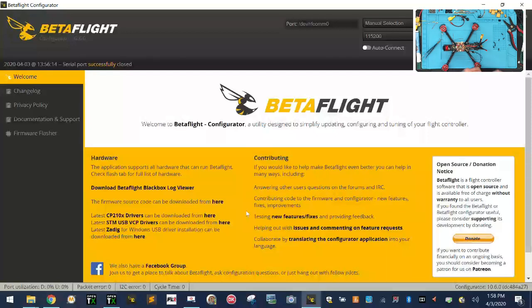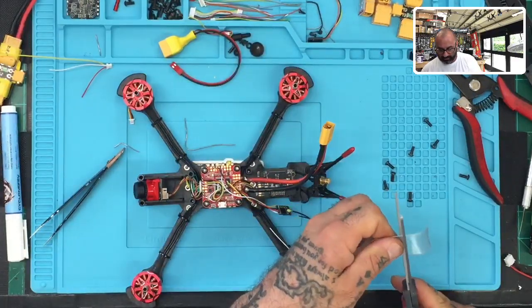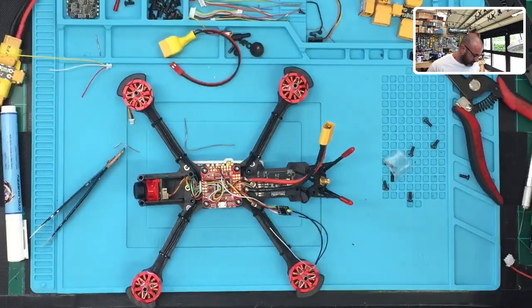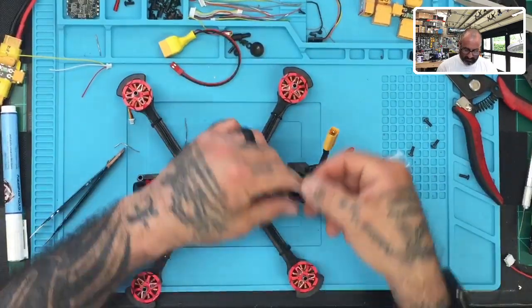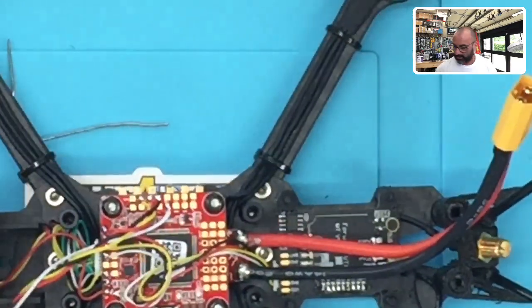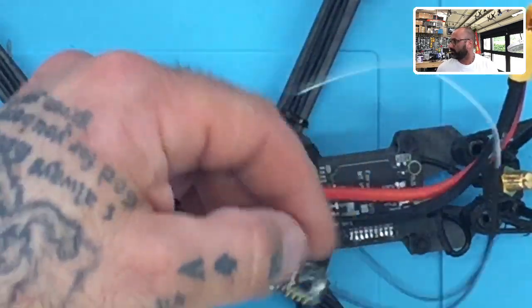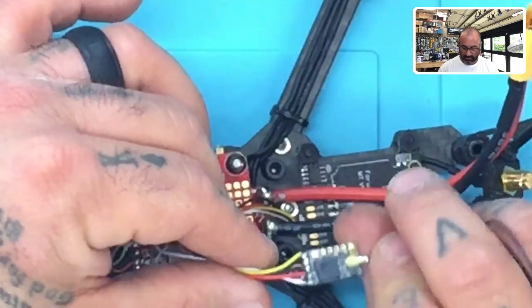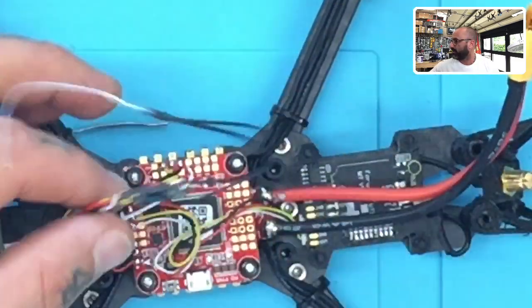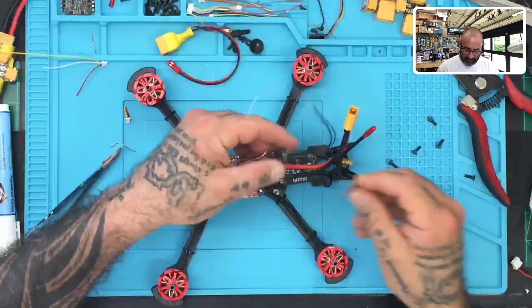So I'm just going to cut a small piece of heat shrink here. Right, okay, and I didn't realize that you guys are having to look at it like that, I apologize. Okay, so we put our TX6 right there, right? So I'm just going to cut off this heat shrink here. Put that away. I apologize for that, but it was right here, guys, in case you didn't see it, okay? So if you want to zoom in a little bit, that's TX6, and that's where I put the telemetry, okay? And then on the receiver, it's wired like that, okay, for the R9MM, okay? Good, so now I'll zoom out, and we'll finish this project up real quick. Then we'll get the radio tested and make sure everything's good.